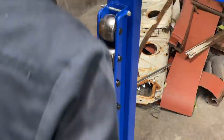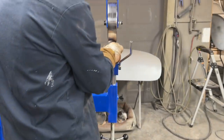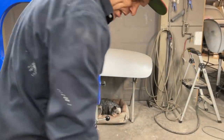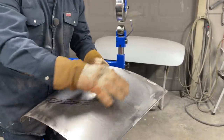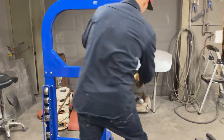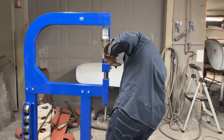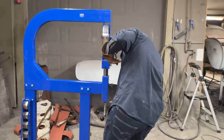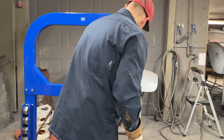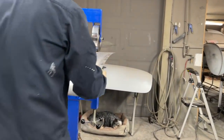I'm going to choose this one, and what am I choosing it for? I'm choosing it because I'm thinking that I'm going to wheel the whole thing. I'm going to wheel the whole piece now, where I've got the center up, and try to stretch this all out to the ends. That makes sense. And if I need more shape, that means I have to come back over and do it again.